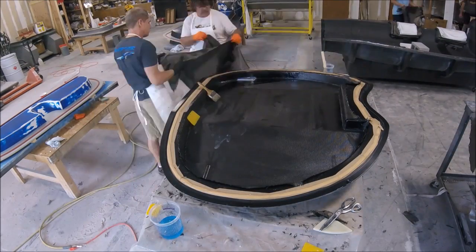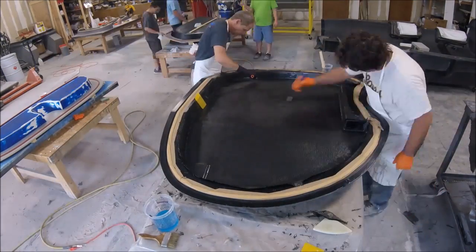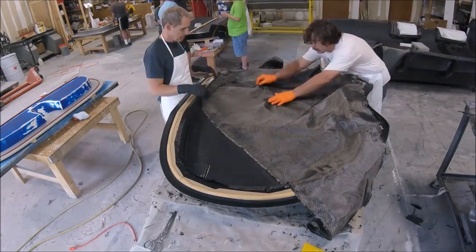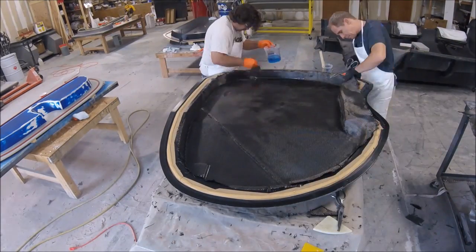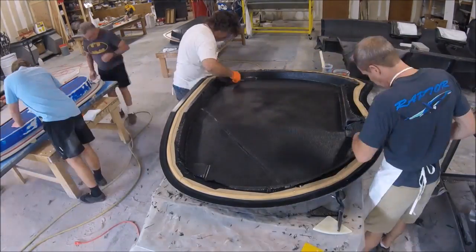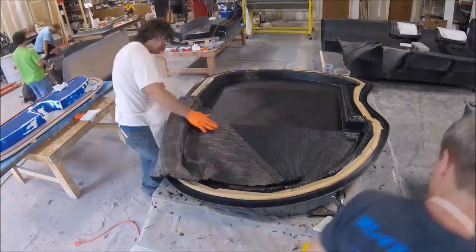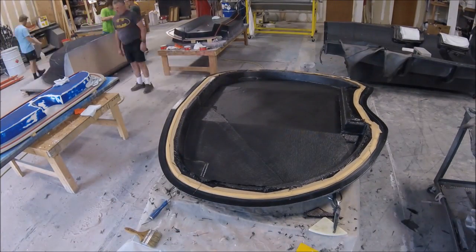Putting in the small piece there - when we're laying these parts, we lay the fabric on a 45-degree angle, which means the ply is running in the right direction. Here's the second layer going down. It's important that we get the fabric lined up carefully so it's not being stretched in one direction or another. We also make sure it's wet down just the right amount - you don't want it too dry or too wet. Of course you've got to work all the edges, dart the corners, and make sure it's covered nicely. That's basically the first two layers going down.